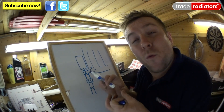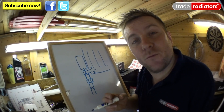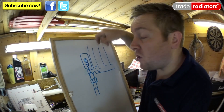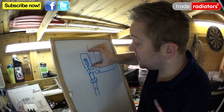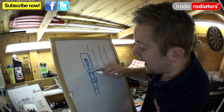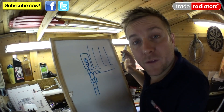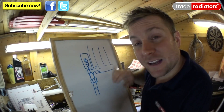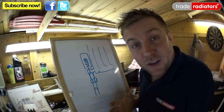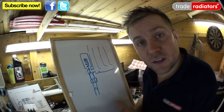Other thermostatic radiator valves will use a small wax canister that, as it gets warm, the wax will expand and push down. The simpler version uses a metal coil inside the head. According to the temperature you want in the room, when you open and close the radiator valve, the whole body will either move slightly up or slightly down. When the room is cold, the spring will contract and allow the jumper to lift up, allowing hot water into the radiator, warming it up and therefore warming the room. When the room is hot, the metal spring will expand and exert pressure on the radiator pin, shutting the valve and stopping flow into the radiator.